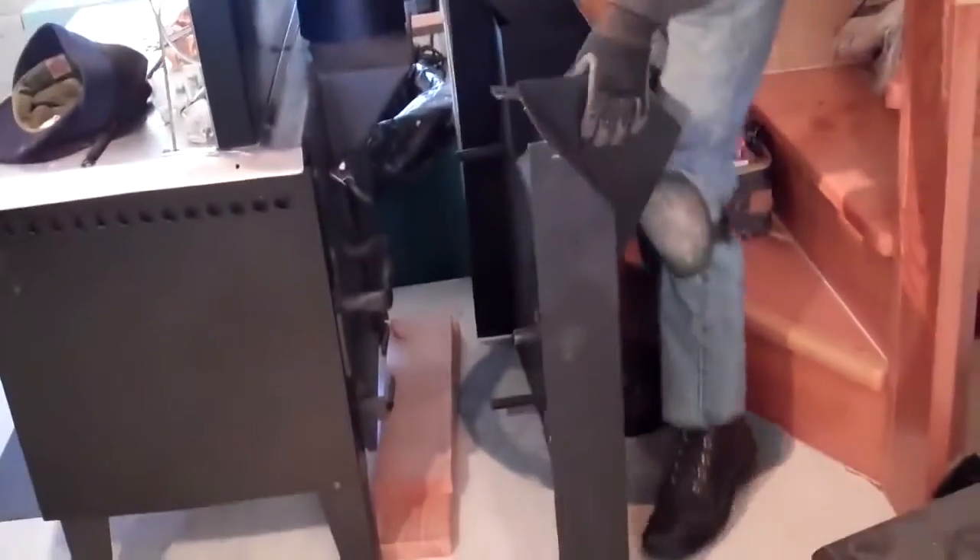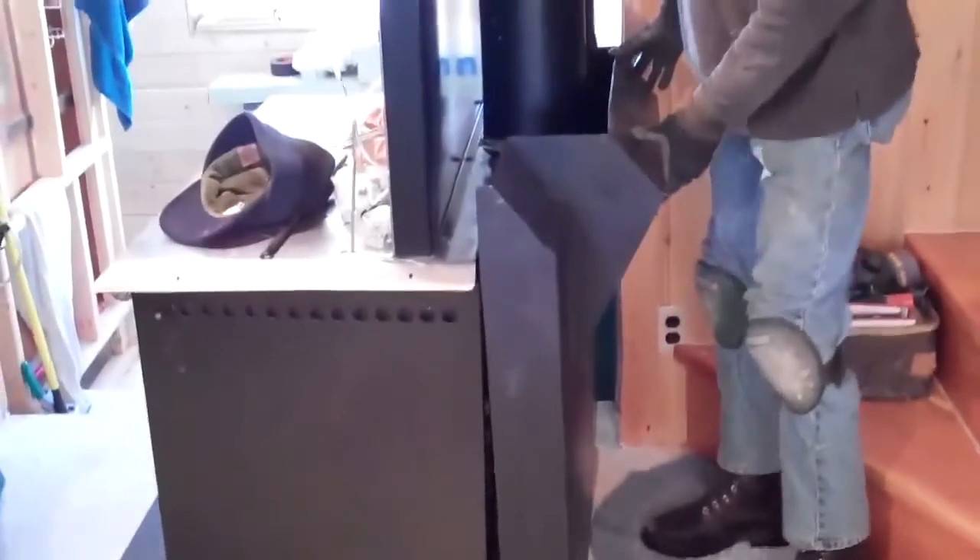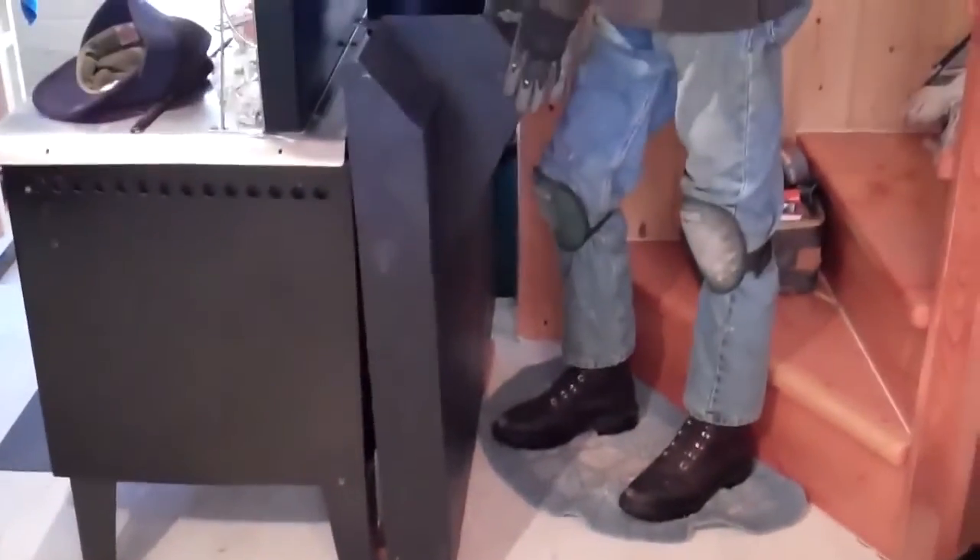On the back of the stove we still have 36 inches clearance required — this thing gets really hot. So we developed a heat shield that mounts on the back of this stove. It's designed with two layers of steel with an inner layer and an air channel between them, so air moves up and vents into the room — the exact same principle as the chimney pipe. The clearances to combustibles with this shield are knocked down to six inches. But because we also put the heat shield on the wall, we will have zero clearance. Casey is now going to set it behind the stove — it mounts on the back just about like that.